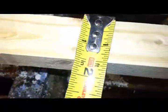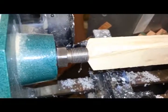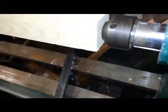So now here's the piece of wood that I've cut in half. Trimmed it down, it's 1.5 inch square. And I used a 30 degrees cut on my chop saw to give it a point, and then I used a centering device template that I have to come up with the center on this, and I've just squeezed it together.